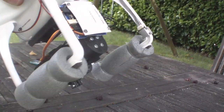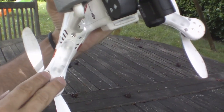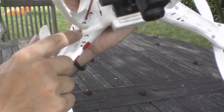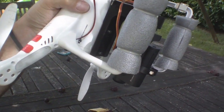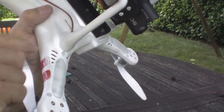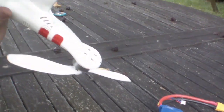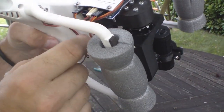The other thing I had to do is open up the case of the drone, which means removing the screws — there are 2mm allen key bolts and a cross-head screw, which is quite hard to get off. It's easier if you don't have the legs on. You can then lift off the top once you've taken all those bolts off. I soldered on a little power lead here, coming directly off the 3S battery from the drone and going into the board, and then we have the roll and pitch motors that plug in here.